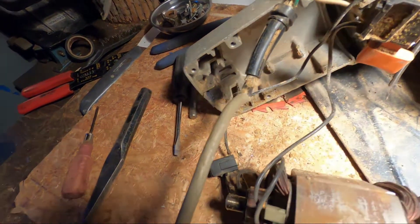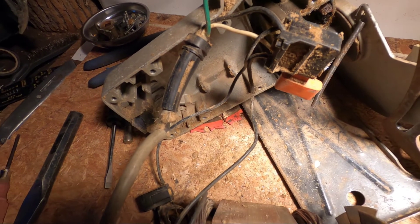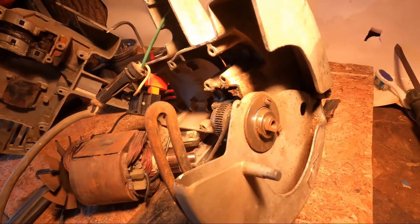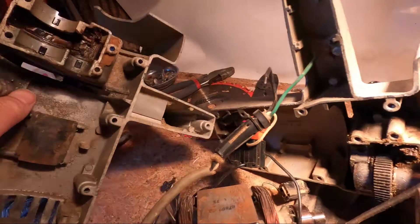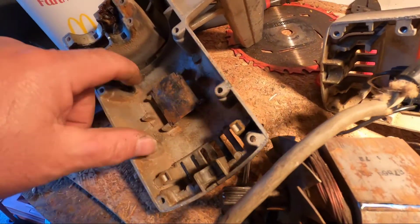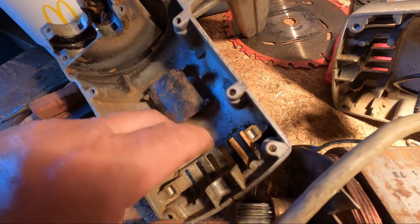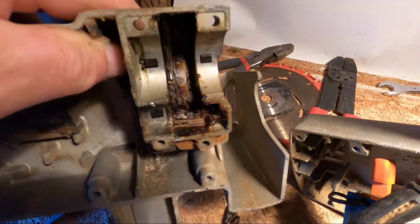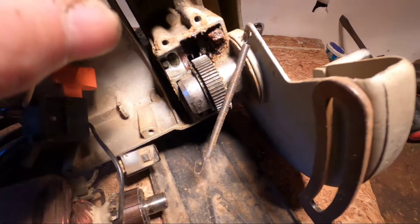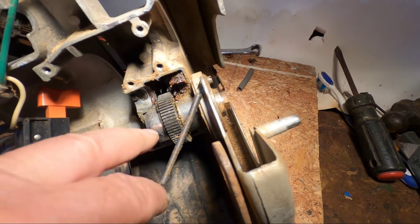I'm getting off camera for now, and once I have this cleaned up, put back together, and get these brushes in, re-grease this, sand this down, and clean this all up, I'll be back to show you whether it works or not. It was working before I took it apart — I hope it works when I put it back together. In for a penny, in for a pound. I started cleaning this up on the inside — I thought it would just come out with a soft brush, but I'm going to have to use a screwdriver and then a brass brush. This grease is pretty caked up with sawdust in there.